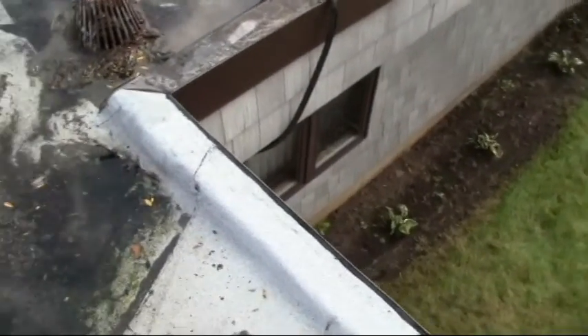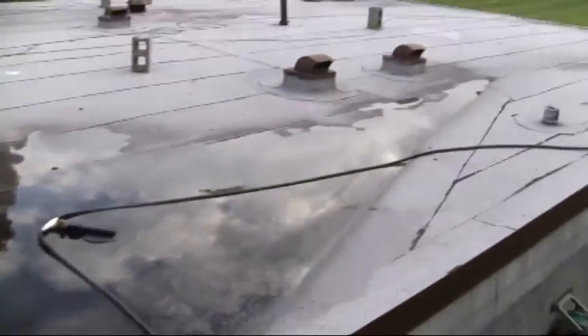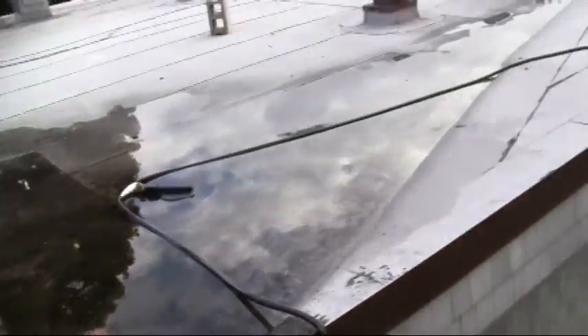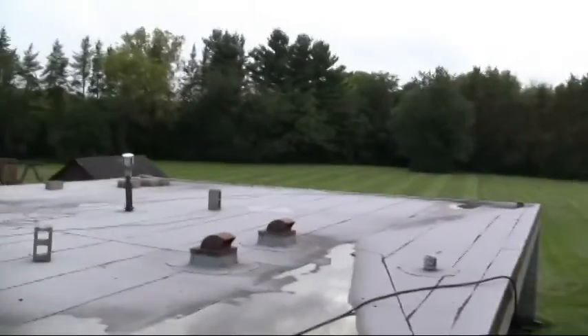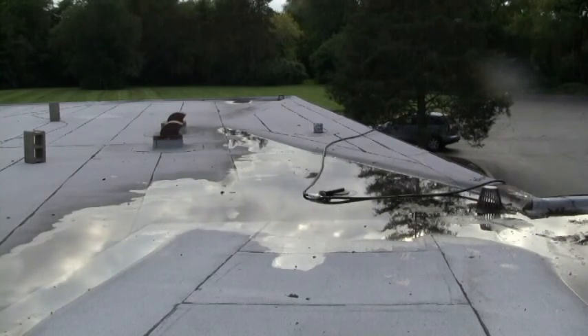This organization just had the roof rebuilt a year ago, which shows you that rebuilding your roof is a very quick fix but not a reliable solution. There's the flow right there, acting as a portable drain. The funniest thing is the roof drain itself — look how clogged it is and full of debris, because it does not have anything to protect it from that debris. You can see the vegetation around this roof; it's easy for debris to accumulate here.